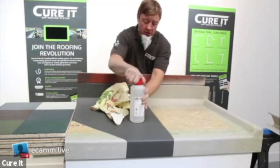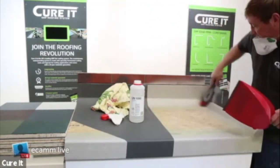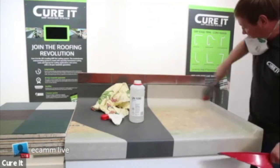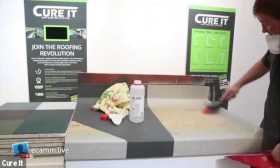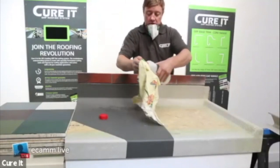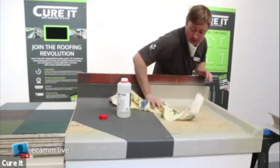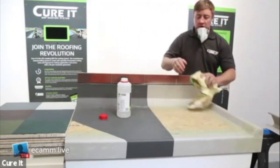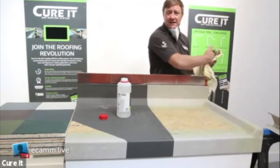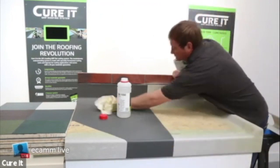The best way is to brush it off first or use your acetone. What you're doing with the acetone is getting rid of the dust off any details - that dust will affect the bond if we just put top coat straight on. We want a nice clean surface. Also, once you've sanded, get some acetone onto a rag and wipe that surface over. What you'll find is this will evaporate all the dust and debris, giving you a nice clean surface. As a bonus, the acetone slightly takes the resin tacky again - it rejuvenates your resin for a very good top coat bond. So once you've cleaned and wiped it, then we'll apply the top coat.